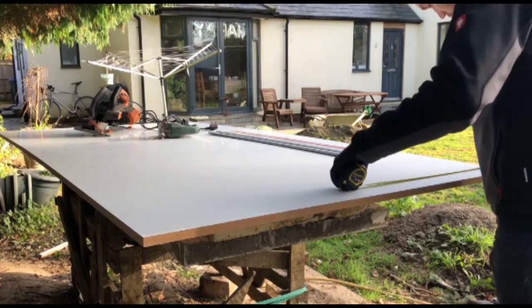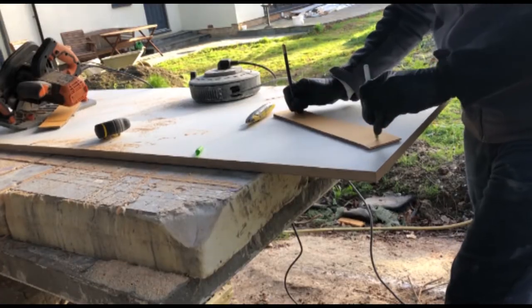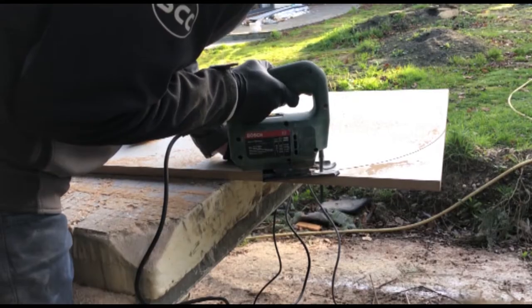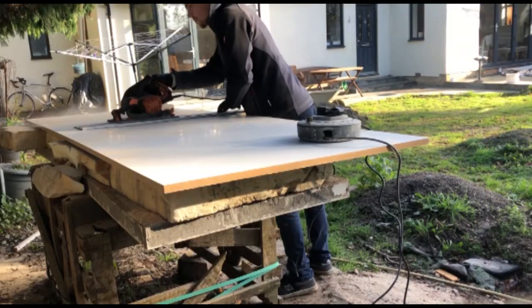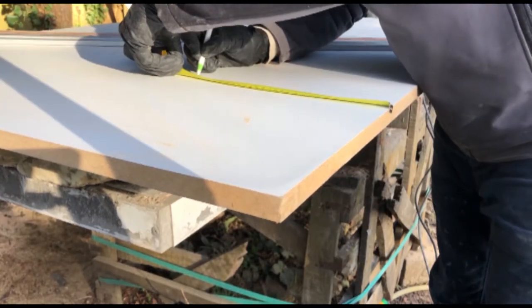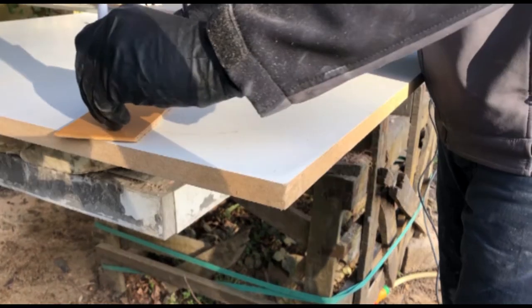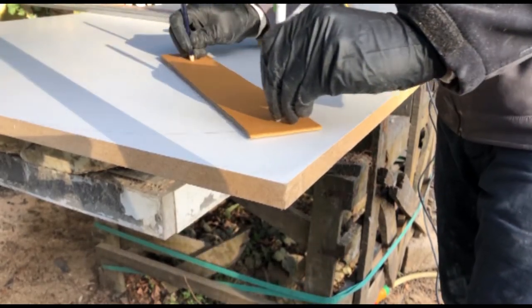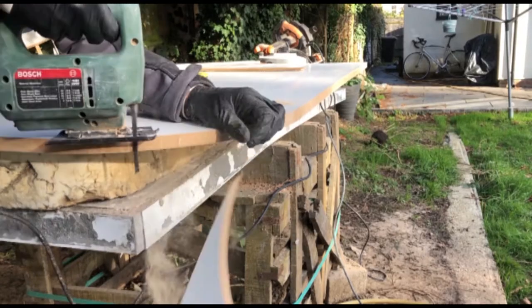It's time to make the base pieces of the moulds — the container that the concrete will sit in when you pour it. I like to stick the side pieces on afterwards so that when you flip the concrete worktop over, the top side will be accurate to the bases cut out originally. We've also got a couple of 300mm radiuses on some base pieces. Mark an indentation 300mm in from each edge, make a cardboard jig with two holes 300mm apart, mark out the rounded edges with a pencil, then cut them out with a jigsaw.